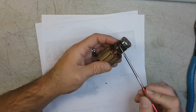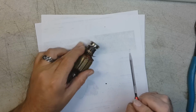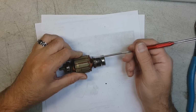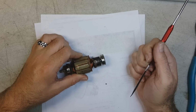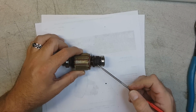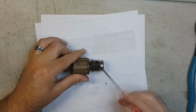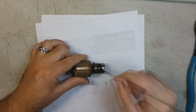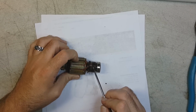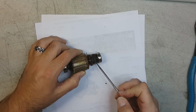And look how burnt black it is. And look at the bare wires from the armature showing. Look at that. Complete meltdown. See there? These are wires from the armature coil. They're just sticking out. Because it's got so hot that not only has it thrown some of the commutator plates, okay, I can't even pull them off with my pick. That's the thing. I can't even manually remove them, but yet somehow a good 2 centimeters of them are missing. 1/3, almost a half, is missing.